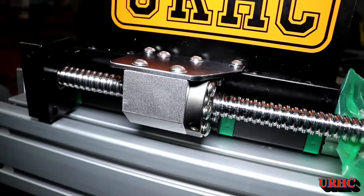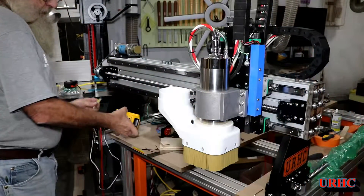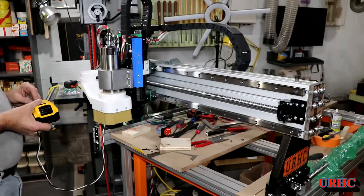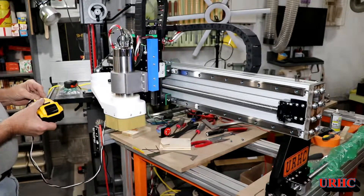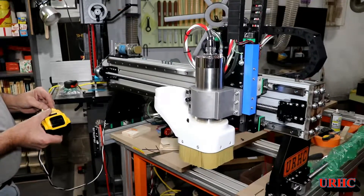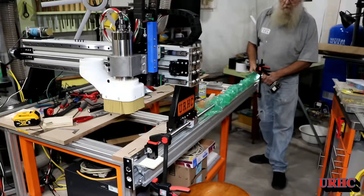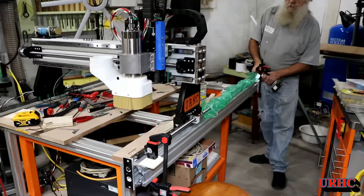I've got one lead screw on this side and another is on order - I wanted to see how they looked before ordering more. Still have some end plates to make. Here I'm throwing 20 volts to the servo motor just to see how smoothly everything moves - it's really super tight and moves well. Once it's running under the controller it should be fast and powerful. The X and Y and Z are mostly done now, just working out the X. I can see that one lead screw has a little bow in it that I'll need to work out, because when it moves fast it whips a little bit.